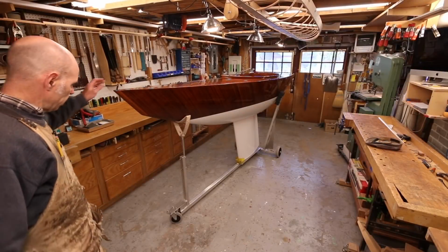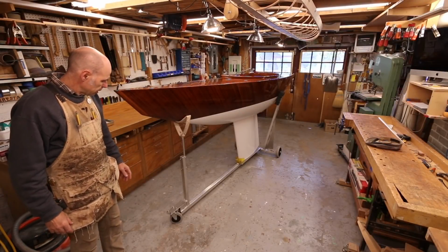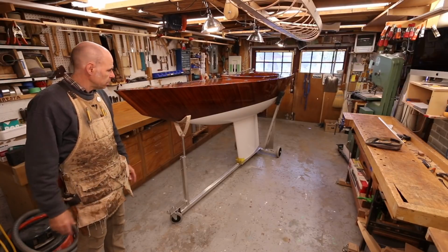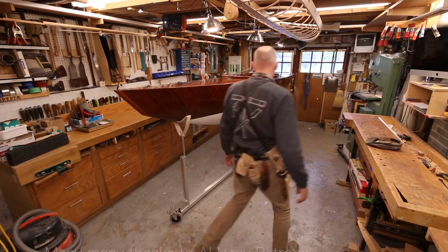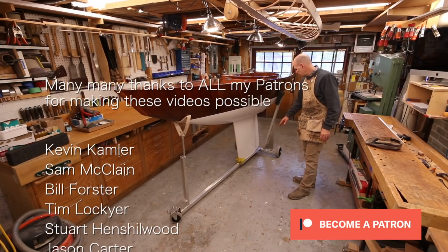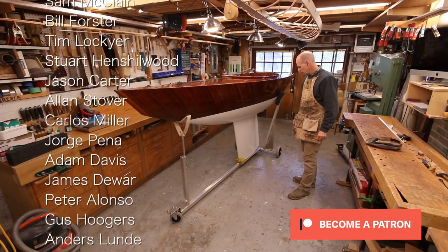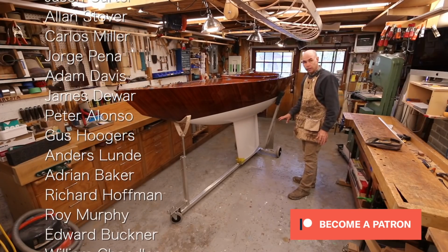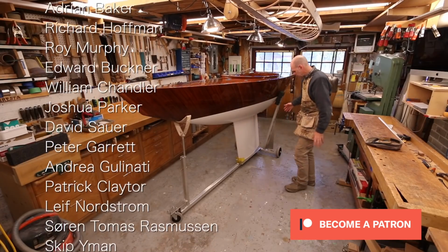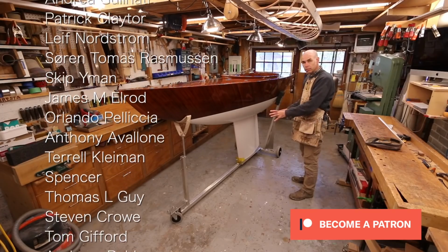All right, just a little quick review of the dolly here. We had a local welder throw this thing together, and it's quite different than the dollies the rest of these boats use. The rest of them have this awkward situation where they have a balance point right under the keel, and they have to play around with rocking the boat back and forth to get it to sit just so. But anyhow, I think this is going to work out well. My customer came up with this idea of using this little chock down here that's just to stop the keel from moving forward, and it just locates the boat on the dolly.